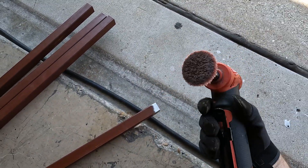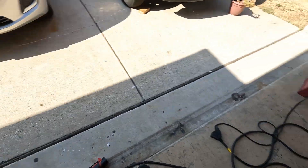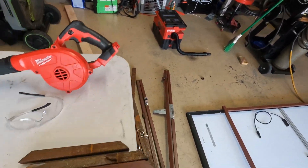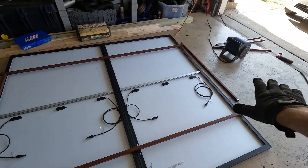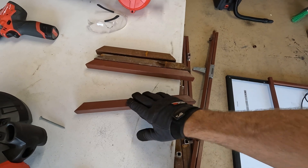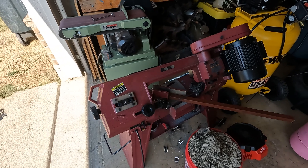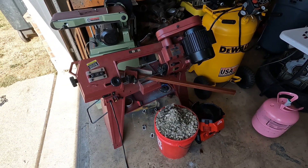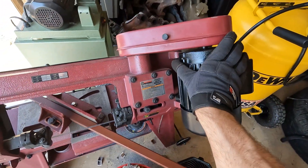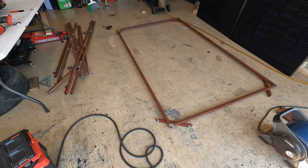Using this little Milwaukee tool with a buffing pad to get the paint off for better welds. I'm going to do it to all the legs. For gusseting, I'm using these pieces here — they're going to help the legs have strength. If I welded the legs straight to the frame without gussets, it's kind of flimsy because this is only 14-gauge square tubing. It's really strong but still has a little give to it, so these gussets will give extra support. I did go ahead and buy some new steel — should have plenty of material for this one and at least one more.